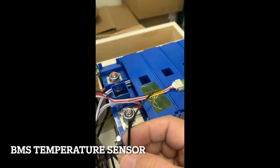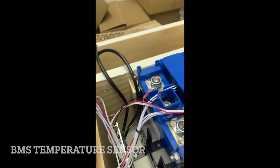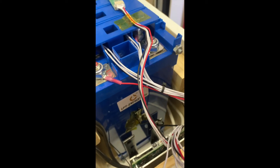I have the two battery temperature sensors. I'm going to pick one and put it in between cell three. I just put the camera down. I didn't have the length to get over where I wanted to, so I just have it on the side of the battery. The tip of it is the thermistor, so I left that uncovered — didn't want to have it insulated. So if the outside of the battery gets colder before the inside, I'll have a heads up before anything gets out of whack.